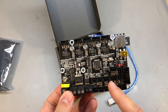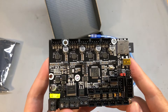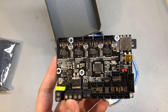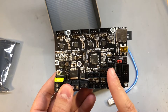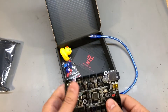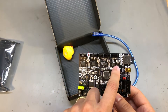This will be a great starting base for future upgrades and really makes your life easier. For example, if you want to install a BLtouch sensor, there's no more messing around with cutting and soldering wires — there's a special connector for that on this board; you just plug your sensor wires directly into the motherboard. I'll cover the installation in a separate video. I just wanted to show it in this mailbag, along with the small heatsinks for the stepper drivers that come inside the box.